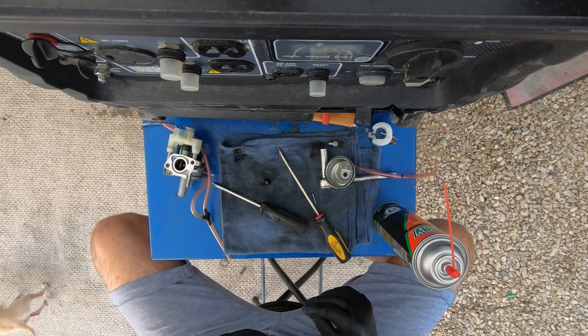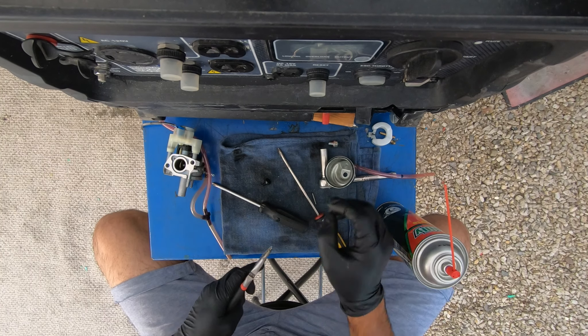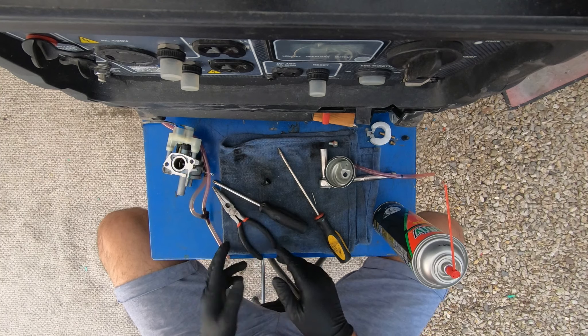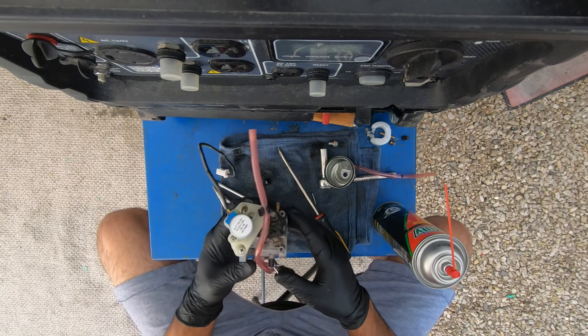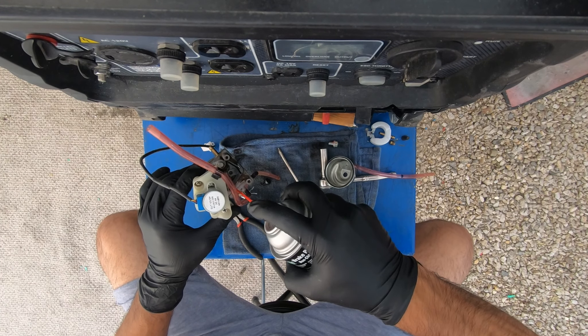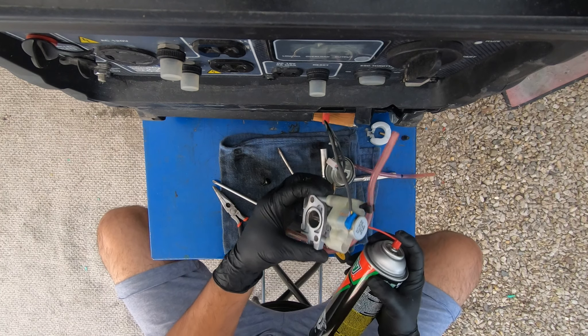I can already see that jet spraying, which is a good sign. I'll leave it with the rest of the clean ones. There's so much sand on this generator — I really don't know what they did with it. Before we reinstall, we're gonna go ahead and clean that hole where the jet came from. We'll spray in there — always being careful with your eyes.